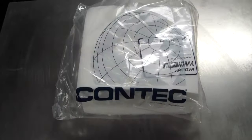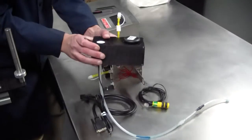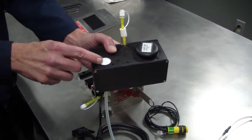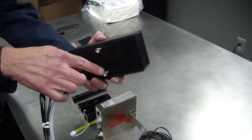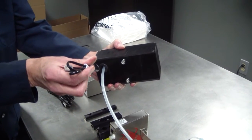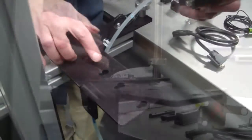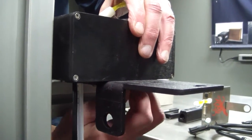Very few tools are needed to assemble the Co-Pilot 382 printing system. First, mount the ink reservoir to the printing system mounting bracket. The ink reservoir contains a vent tube, priming bulb, and dust cap for shipping. On the bottom, there are two mounting screws, an ink line to the print head that contains an in-line check valve, and a low-ink alarm data cable. To mount the ink reservoir, line up the allen screws with the appropriate slots on the print head mounting bracket. Tighten the allen screws.